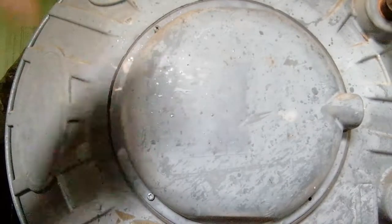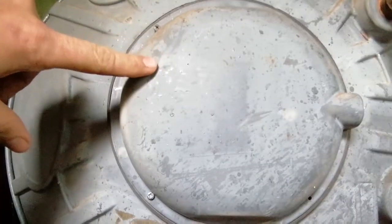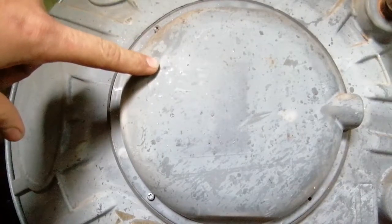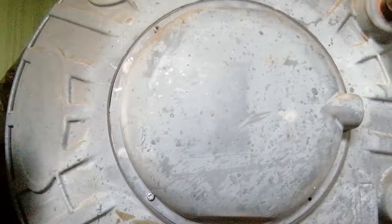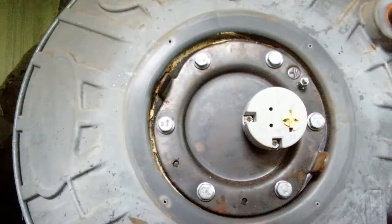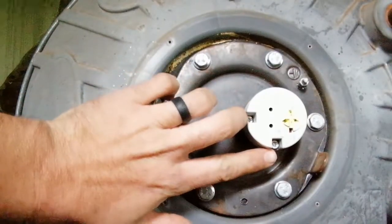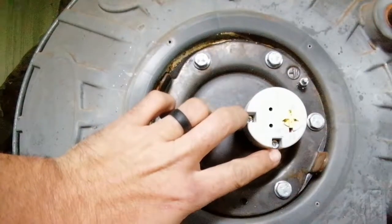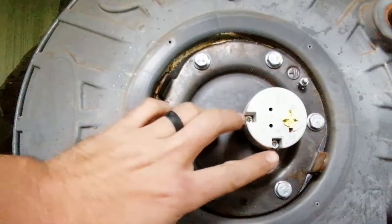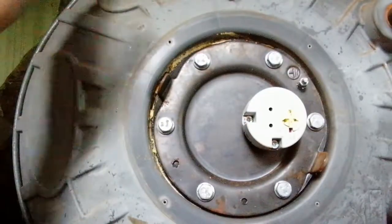The first thing you've got to do is make sure there's actual power coming to your hot water cylinder. Let's take off this cover — this is just an old hot water cylinder I'm using as an example. When you open it up, you'll see the main cables coming in to the live and neutral connections. Check if there's voltage: in my case 230 volts, though some other countries use 110 volts. Make sure live and neutral are present, then you know your circuit breaker is fine and the problem is on the cylinder itself.